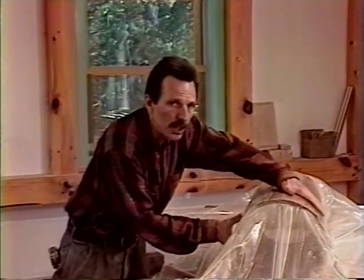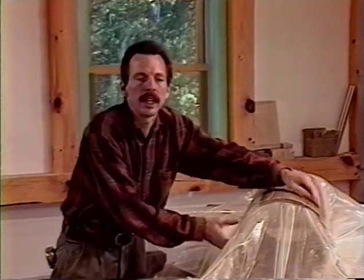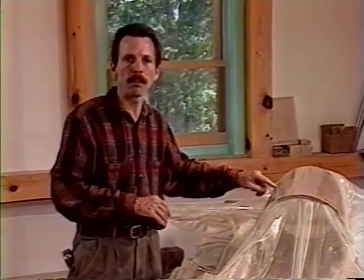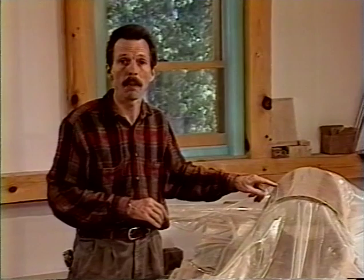While we're waiting for the glue to cure on this cylinder, let me explain more about the heavy paper and what it's for. When this bag begins to tighten around this cylinder, it stretches in this direction. If I don't have something fairly stiff, or at least non-stretchy, between the bag and the veneer, the bag will try to pull the veneer downwards with it. This can result in veneer tearing long way, developing cracks down the length of the cylinder. Something to be aware of.